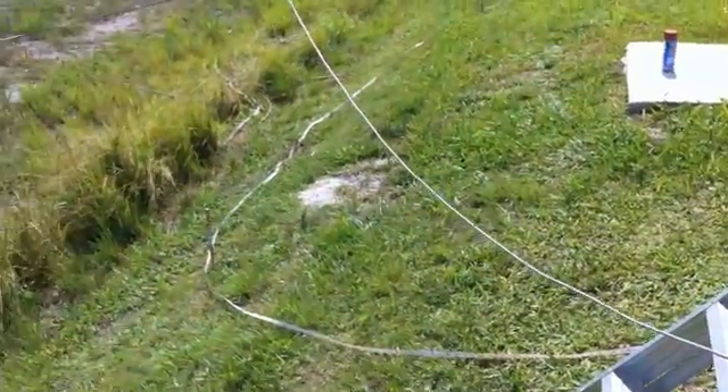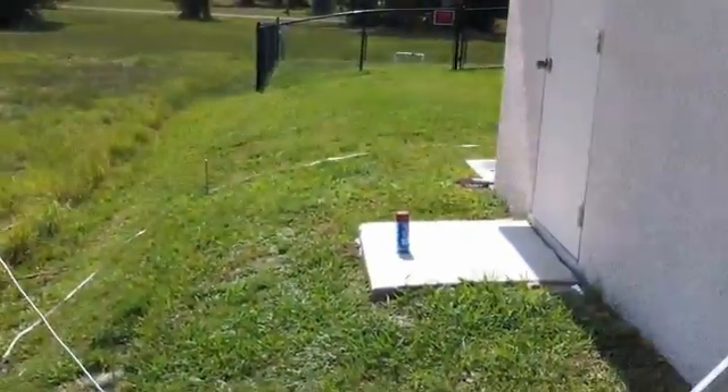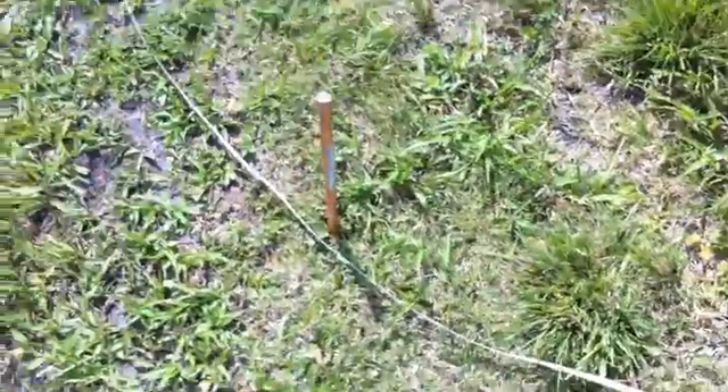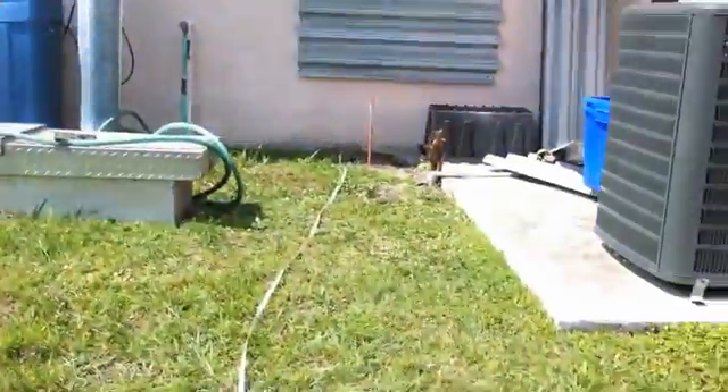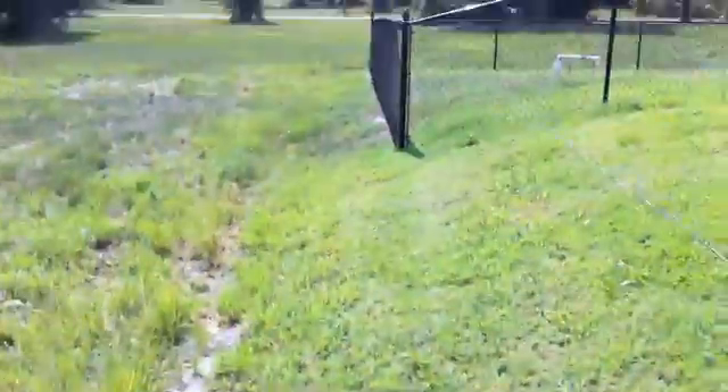I'm putting these in with a hammer — dying out here. So that's the arc. As long as it's an arc, don't try to take your ground and make it a 90-degree turn — you're okay. I'm going to come all the way out here like this. Because I have more strap left, if I need to I'll just come off of here the other way and go out that way.